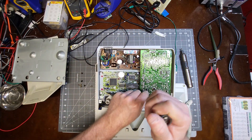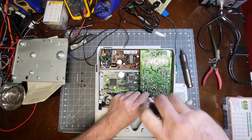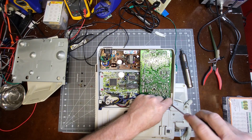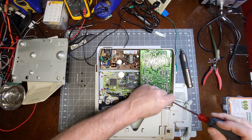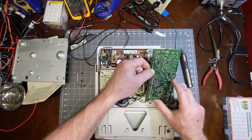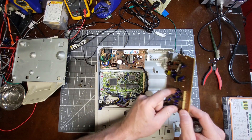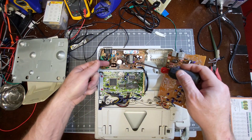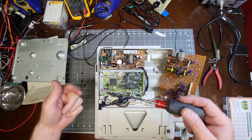It's a pretty shiny board. Get that one out and then this one out. This board has a connector on it so you just slowly pry it up, and then remove this screw, that screw, this screw, and that screw, and the power supply will come out.